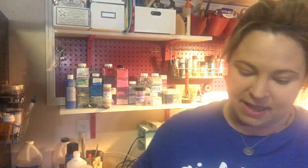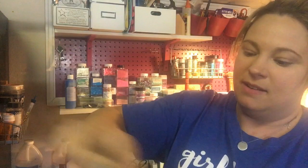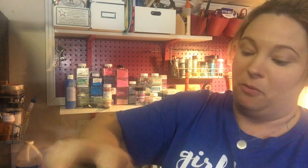Now on these wood grain cups, I recommend that you go with your wood grain, just like you would for real wood. Make sure that you sand up and down with the wood grain. Don't go left to right, because in that one instance that you actually get a scratch, if you did it too hard, you don't want it to be going the wrong direction.